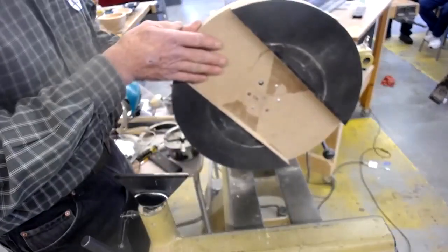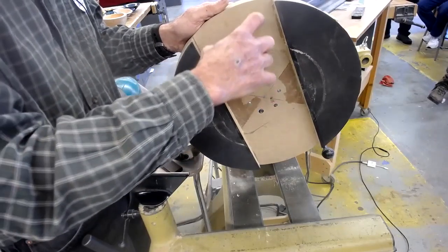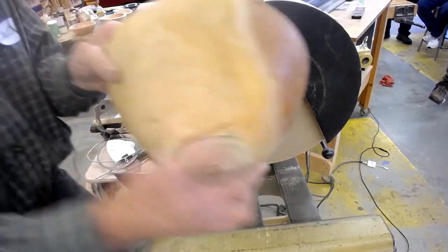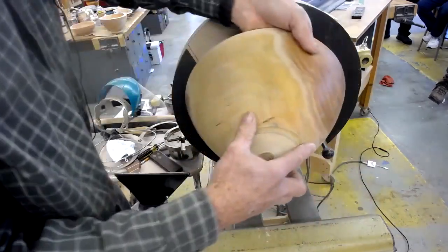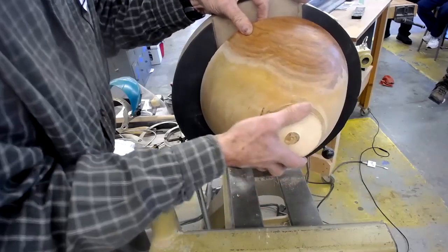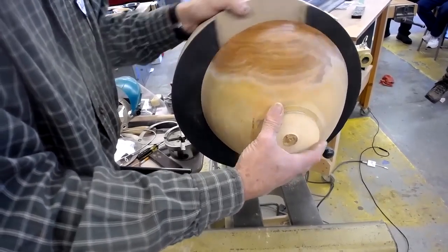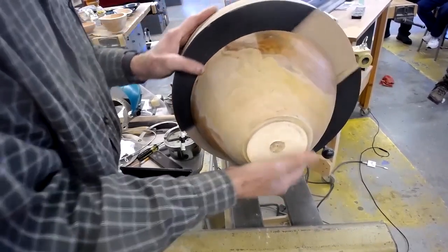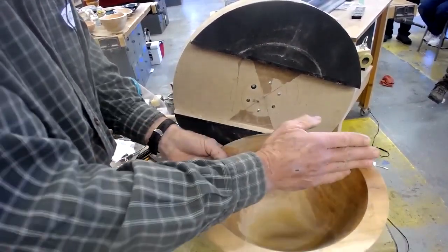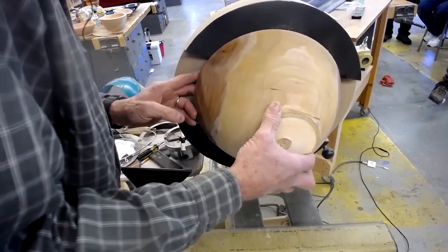that leave a natural groove down the middle. Mine's about 6 inches. If you do a lot of smaller bowls, probably one that's only about 4 inches in the middle works better. And then, because if you put it there, see it wobbles. You move it around until you get to the point where the high points sit in the groove, and you've got a fairly flat surface. This is a really warped bowl, and the fun part about it is that the pith runs sort of off to an angle. But what you're trying to do is get it so that you get as little rocking as possible.